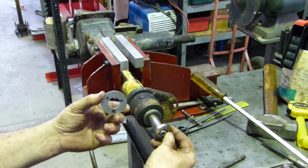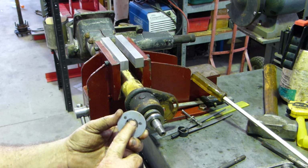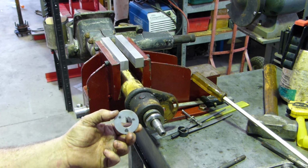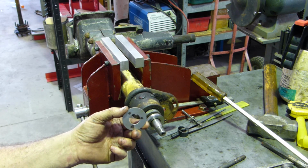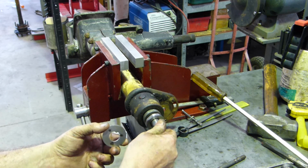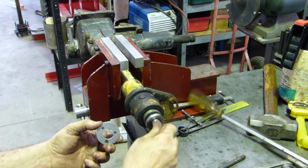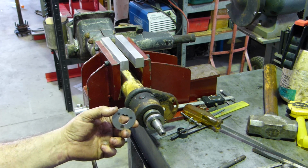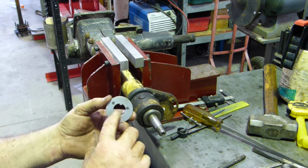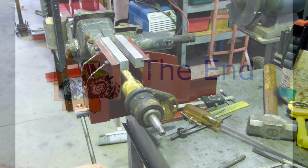And so one each way over here, but this little tag that's on this washer won't be usable, but we should be able to still lock them up together and fold the tags over to stop them moving so they won't lose tension on the bearing. But that's okay, that's feeling okay. If we can turn that with our hands now, well, the steering wheel with the purchase you have on a 17 inch steering wheel, well, that'll be plenty. So I'll go and I'll knock this out, and we'll put it on, and then we'll lock this top nut up.